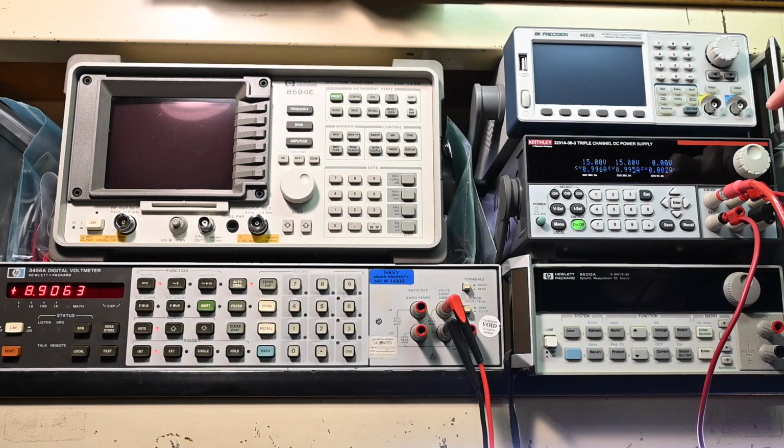So if you put a load across the rail to rail, you have to factor that current into any loads that might be on the individual supplies. Again, just keep that in mind and how that current flow adds up. Because of course you can't overload the power supply.